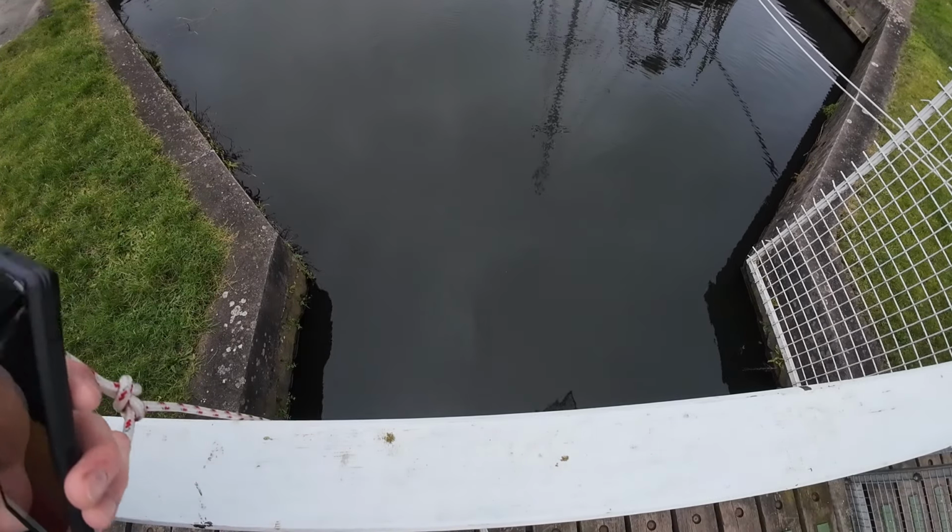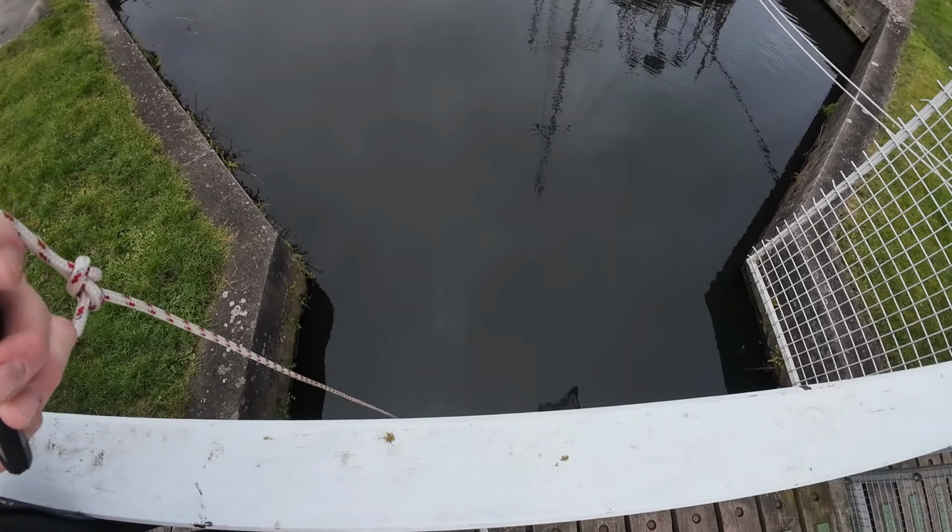Ooh. Oh, so when it does that, so here we go. So you can see it now, look, working. We're at 1 metre there. And then this range thing will automatically adjust if you want it to. Or what we can do, look, we can do these parameters now. We can do depth range. Let's do it from 10 meters. And then we can also get a shallow alarm at 1. Let's leave it at that. Oh, there we go. That's because we're under 1.